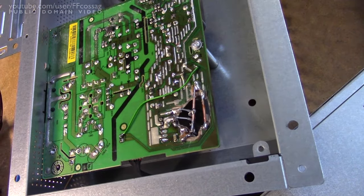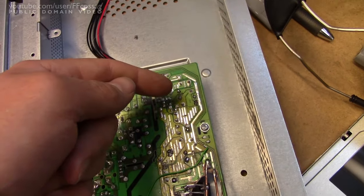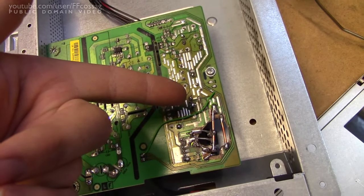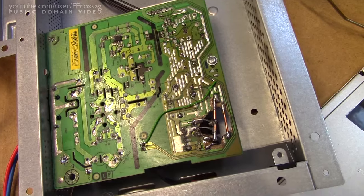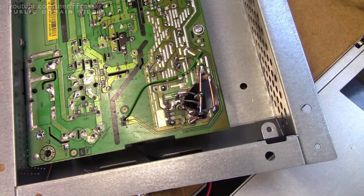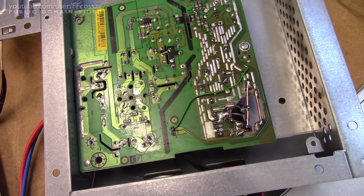Thanks for watching, cheerio! If you're curious, I just measured around — the power supplies in this thing are across these caps here: the 470 microfarad 16V cap is a 5V rail, the 470 35V cap is a roughly 20 to 24V rail, and the boosted voltage out of the converter circuit on those two pins at the edge of the prefab module is about 55V. So there you go — a bit of info. Cheerio!